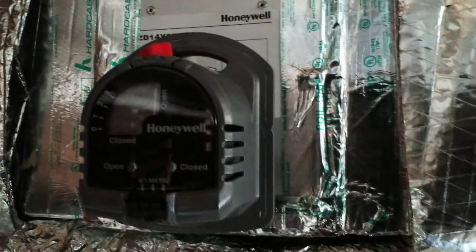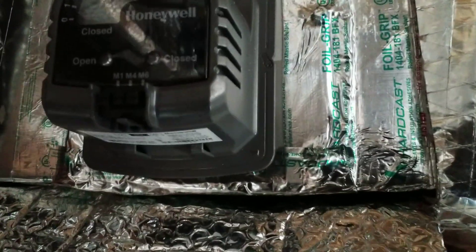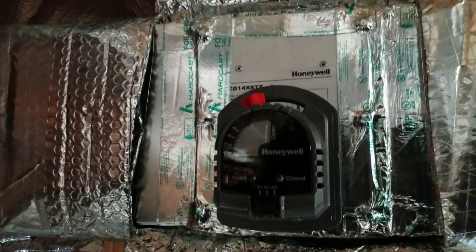This is what it's gonna look like once you've taped it with the mastic. We have a nice thick layer of tape metal to metal, which guarantees a nice airtight seal.